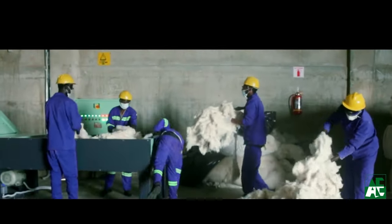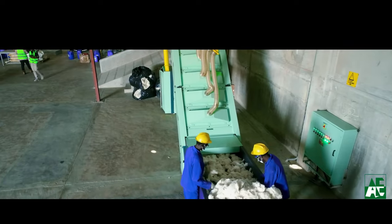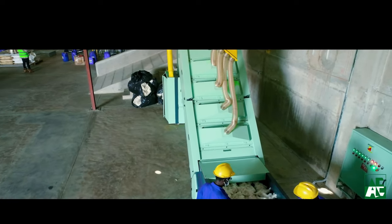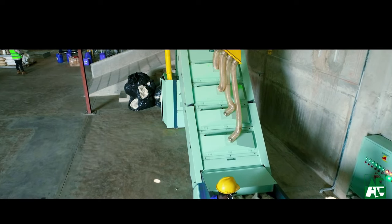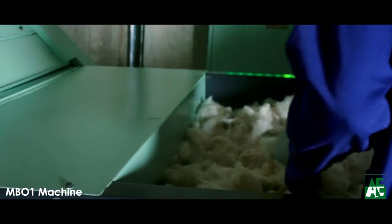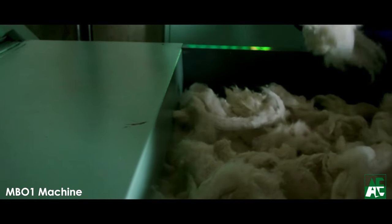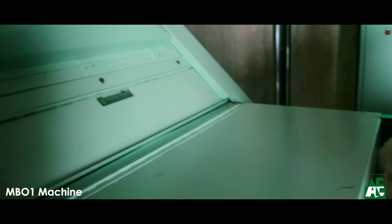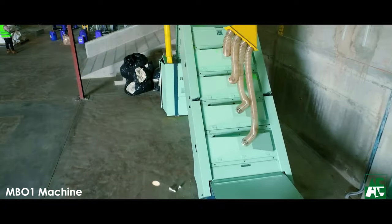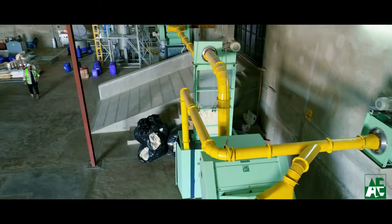This is the initial process of making the surgical cotton rolls using our machineries — the process called pre-cotton cleaning, which is done by advanced technology. The selection of raw cotton is very much essential to match with the medical standards as well as the profit margin and economical view. The raw cotton contains foreign matters like stem, leaf bits, stone, mud and micro-dusts, which must be properly cleaned without affecting the basic property of the individual fiber. The gentle opening and cleaning performance results in the best bleaching and matching the international medical standards.